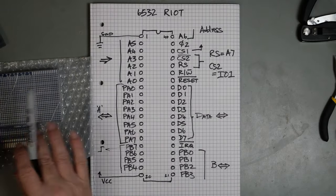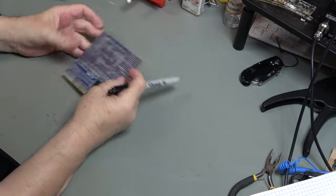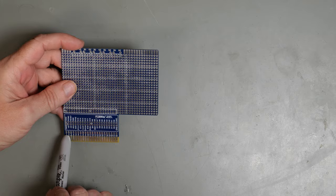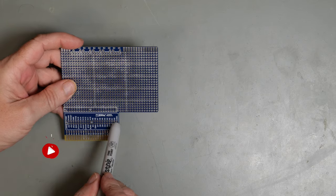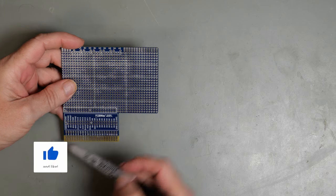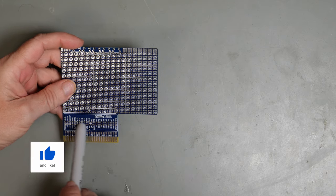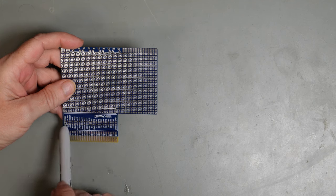And I'm going to use a ZIF socket because we like ZIF sockets. Okay, so here's our board. It looks pretty much the same on both sides. So the edge connector comes out to these pin headers, and they're all labelled. So ground, ROM H, reset, NMI, Phi 2, and so on, and then DC down there, and the other signals.